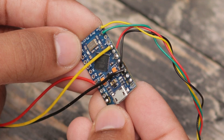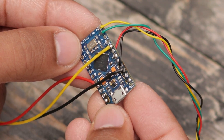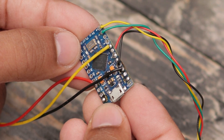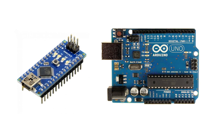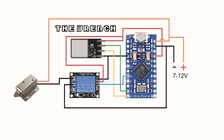I made a small mistake with the wiring of the fingerprint sensor — let me tell you about it. If you are using an Arduino Pro Micro or Leonardo like me, then you have to connect the RX and TX wires of the fingerprint sensor to the 8th and 9th pins of the Arduino board. If you are using an Uno or Nano, then it will be connected to the 2nd and 3rd pins. This is the diagram which we have to follow.